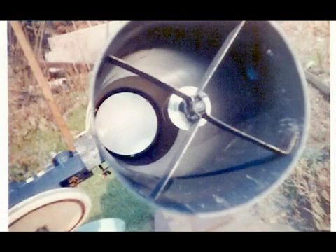Looking down the optical tube again, you can see the main mirror in the background and in the foreground the spider which supports the secondary mirror. The spider was made from old aluminium — I think it was part of a back plate from a gas fire. The secondary mirror itself is mounted in an old spray can cut at 45 degrees so that it directs the light out from the side of the tube. All simple stuff, never cost anything.